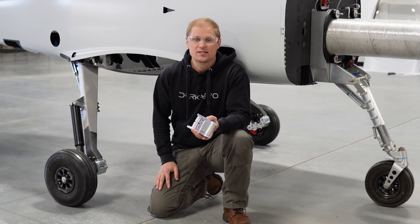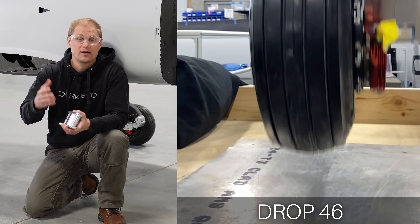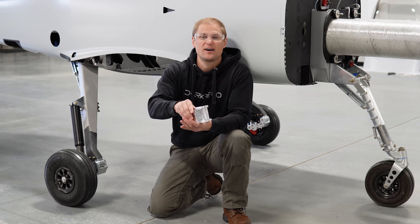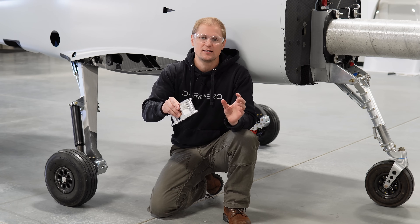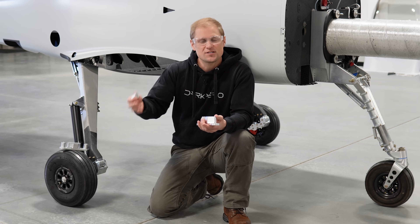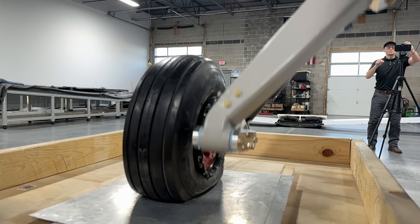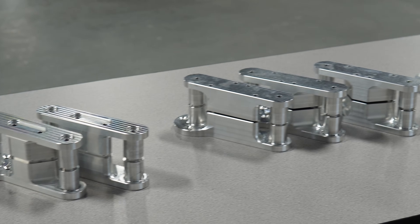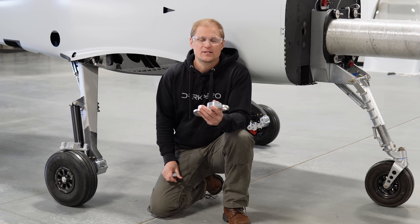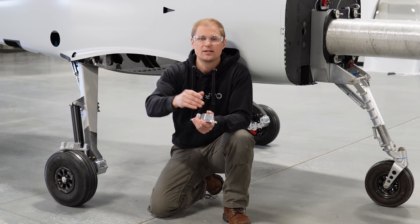The first drop I want to show is drop 46, from phase one of our drop testing campaign. This was a level landing with inclined reaction loads, and we ended up breaking the trailing link on the co-pilot side landing gear. A root cause investigation found a disconnect between the initial design calculations — which showed how much shear area we needed in the part — versus the actual CAD modeling and physical manufacturing, where the part had less shear area than we needed. That led to a redesign of the trailing link with more shear area, which passed on subsequent drop tests. We ended up redesigning the trailing links five times throughout the course of drop testing — most of it related to strengthening and stiffening the part, but some changes related to modifying the geometry to give different action during nose-high drop tests.